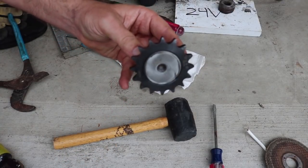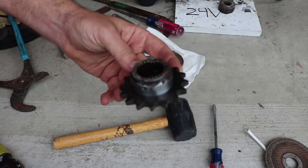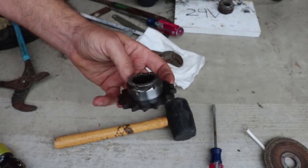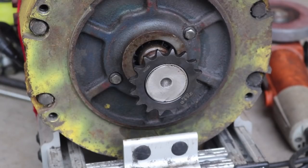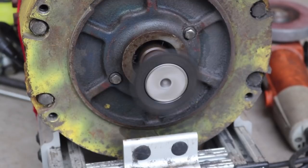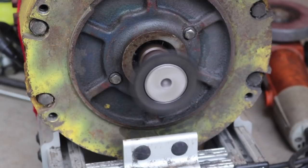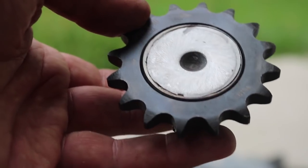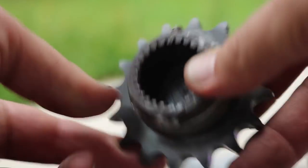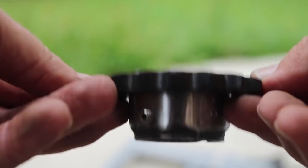I'm not sure how straight it is — I don't have a step or shoulder cut in here like you'd get on a lathe or anything like that. So I put it on the motor and spun it to see how wobbly the sprocket is. Moment of truth. Pretty straight, I guess. I mean, that looks pretty good from here. For not using a lathe, this is looking really good. It's on there pretty solid — I cannot move it off — and it's nice and square.